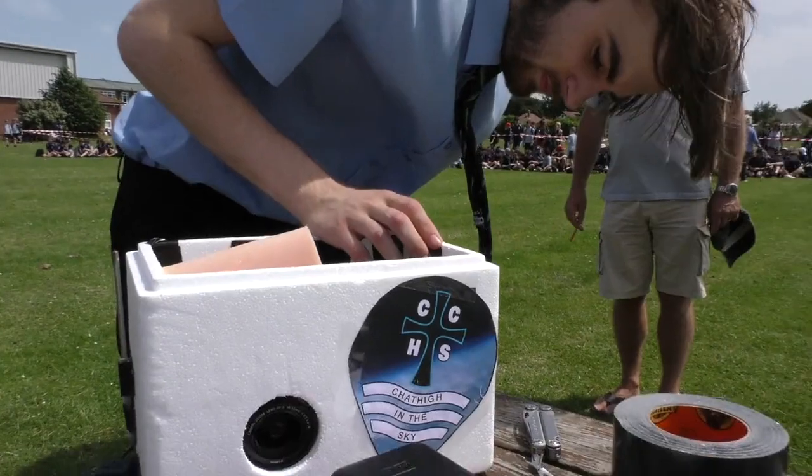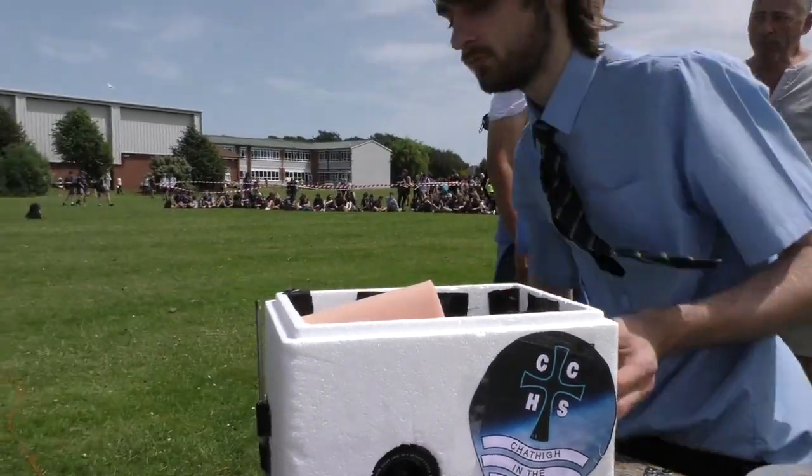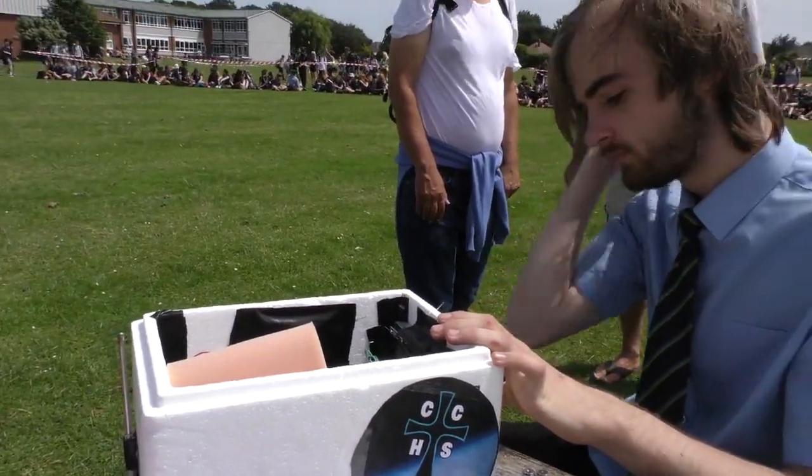We've launched and it's gone up, and now we're jumping in the chase car — also known as the Chatsmore minibus. So when we turned the payload on and powered it all up, the camera that receives live images wasn't taking pictures. But we plugged it in a few times, found one of the cables — the actual camera module cable connecting it to the circuit board — was coming loose. Part of it had clipped up when it needs to be down, so I just reconnected that, rebooted it, and problem solved.